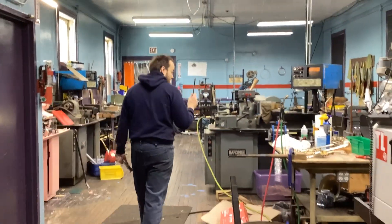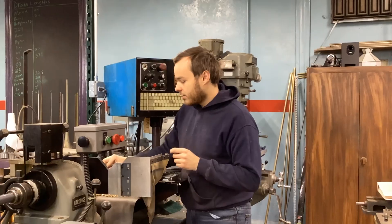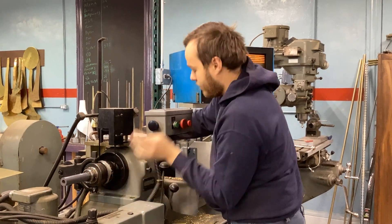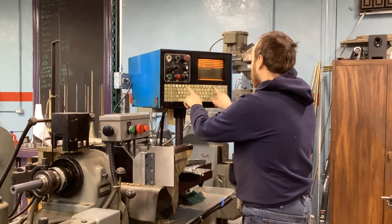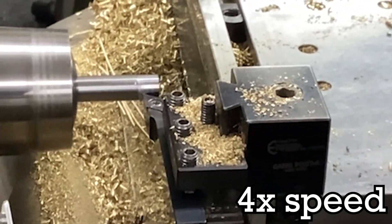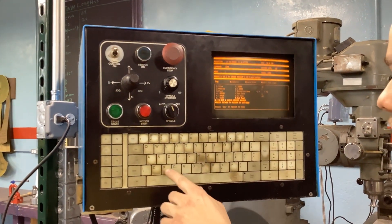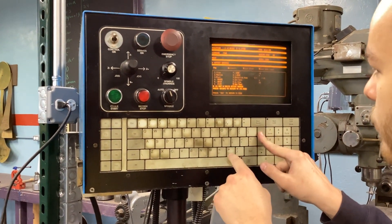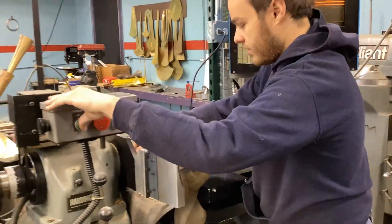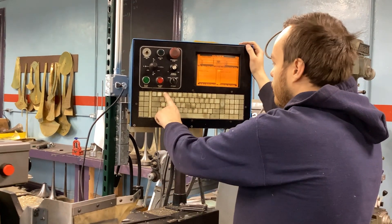Wonderful assistant Dan — I thought Dan died. We have blanks that we keep around that are threaded for our draw bench already. Dave Paul himself made them. I'm just gonna offset our tool — I want to be pretty accurate since we're making the tool, so we're gonna make a little cut here. Tool one for offset, X .45, boom. And then we do our Z. We can load our program — nice old-school technology here with our CRTs.